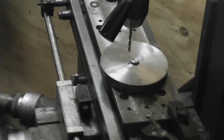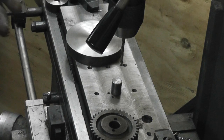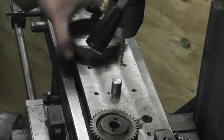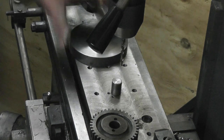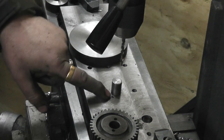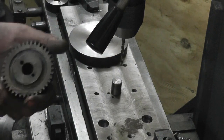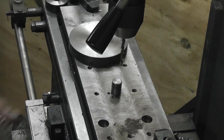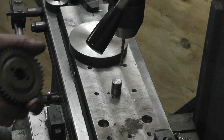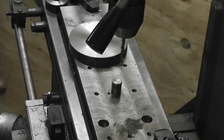This is going to take a while. Now comes the other hole — you're going to have to make the tolerance a little bit freer. When I've actually done all the gears, I'm going to be using these pins as a key when I'm cutting the gears, so I'm making them as tight as possible. I haven't got the sizes that I need — all the gears that I've got, I want to use some of the original gears as well in the mix. The pins on those vary between 4.45mm and 4.7mm, so they do vary quite a bit. I want to standardize the ones that I'm doing so they're all the same size for when I'm cutting the gears.